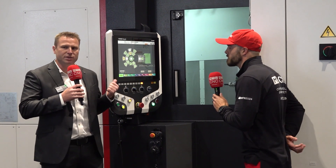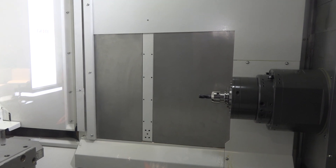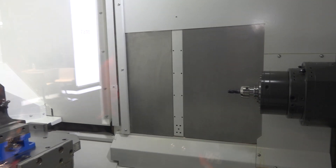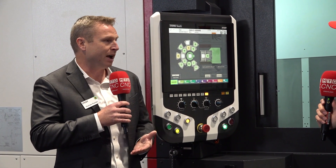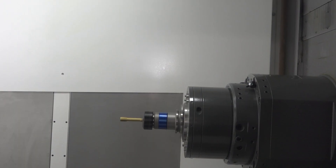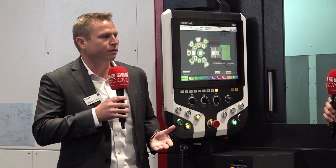Specifically this machine — it's our 40-taper 5000S. A unique feature to us is that we make all of our equipment backwards compatible to all previous generations. We've got pallet automation systems out there with machines that are 25 years old, and this machine will go directly into that system. The pallets we see out here are 550 millimeters by 550 millimeters, a little bit larger than the 500 by 500 you'd see on someone else's equipment — exclusively so we can cater to customers running our legacy equipment.